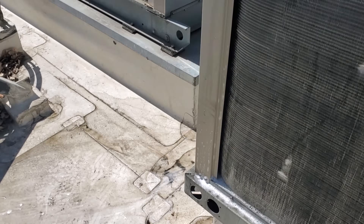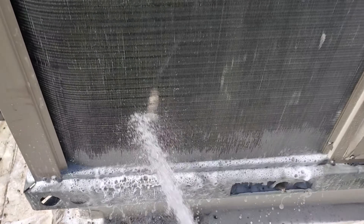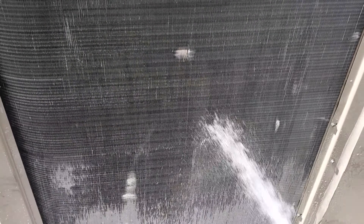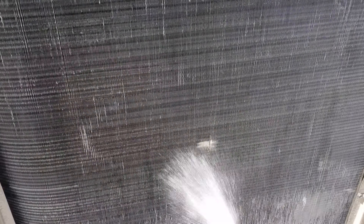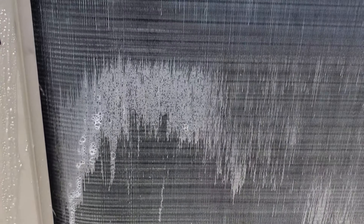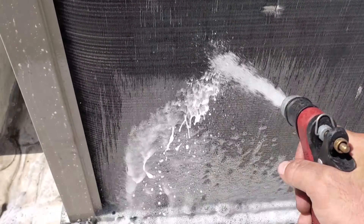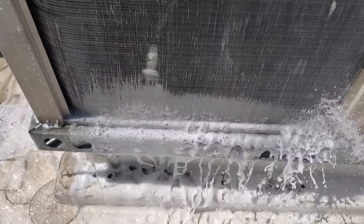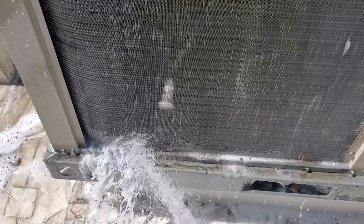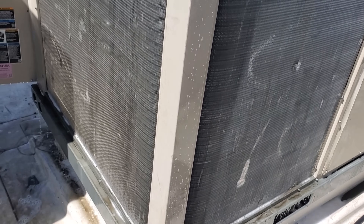Now we're going to go ahead and give this condenser a rinse — again, trying to get from the bottom up. This unit has a split-row condenser, but it's not dirty. I kind of pulled it apart and looked on the inside and don't see the need, so we're just rinsing from this way. There's no way to get on the inside of the coil unless you pull the top and pull the fan motor and fan blade out, and I don't see the need this time — that's why we're just rinsing from the outside in. This yellow Viper pack — it's just soap, guys. It's just a great mixture. It works properly, and it's best to use that whenever possible because you don't really have to worry about anything.